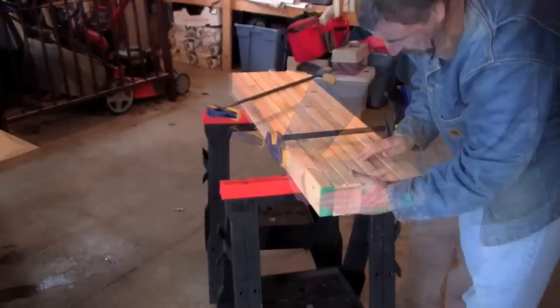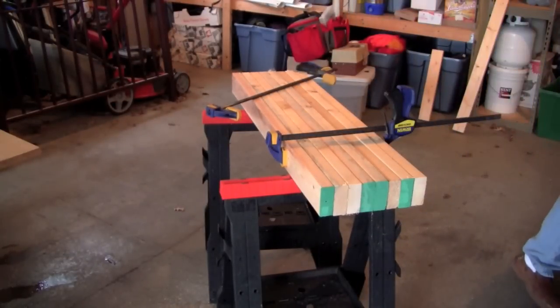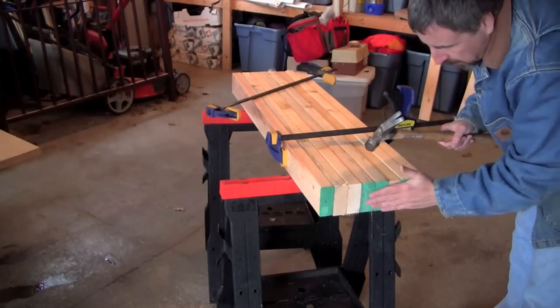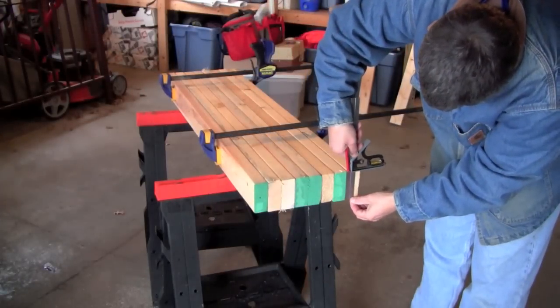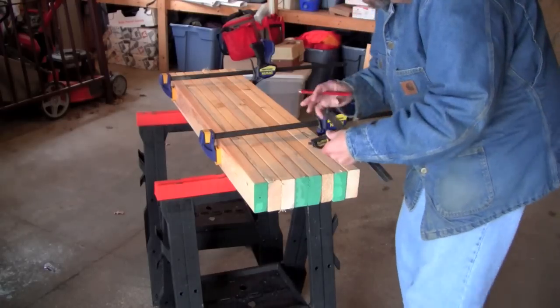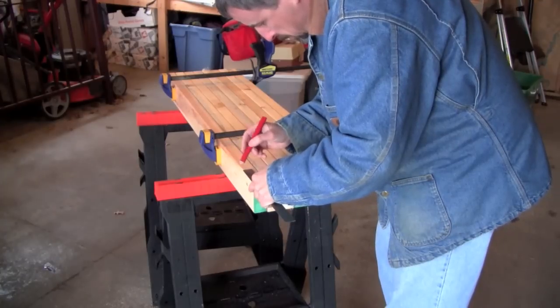To cut the dado joint gaps, line up all the legs and clamp them together. Make sure that the edges of the boards are flush. The ends of the 2x4 rails need to rest snugly into the dado gaps, so measure the size of these cuts carefully. Too small a gap is fixable, but too large a dado will result in a ruined rack.